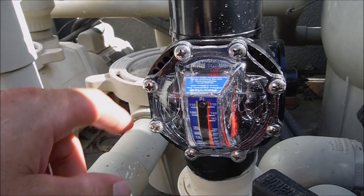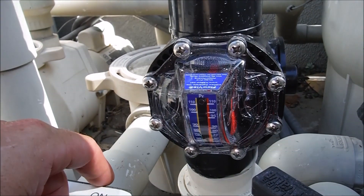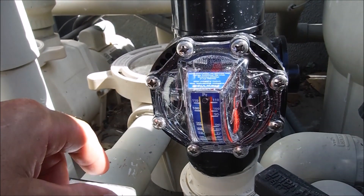Knowing the flow is essential. By installing the FlowViz flow meter, you'll get the gallons per minute. With that, you can set your pool pump to run for just one cycle, which can translate into sometimes a hundred dollars in energy savings.